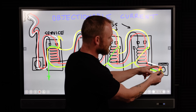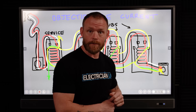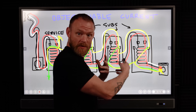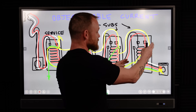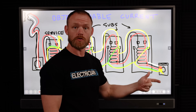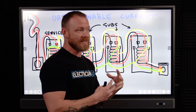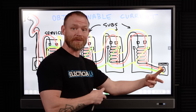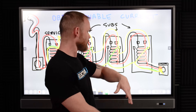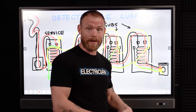The ground exists specifically to direct fault current elsewhere. Say we have a short circuit instead of a ground fault — a hot and neutral touching together. With bonds from neutral to ground everywhere, that short-circuit current is now traveling on all of the metal and that's an objectionable path. A short circuit should be taken care of through a breaker in that one hot-to-neutral loop — we shouldn't introduce metal parts to that short circuit. In either case, bonding everywhere provides two different paths for current, meaning it could go through every piece of equipment and start frying things. You don't want to bond anywhere except that one service panel.